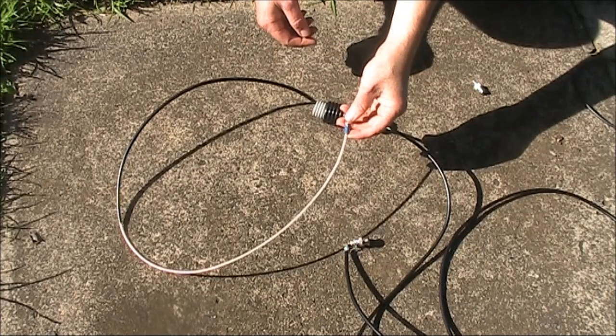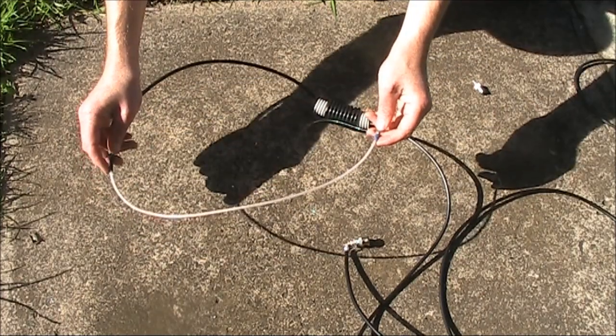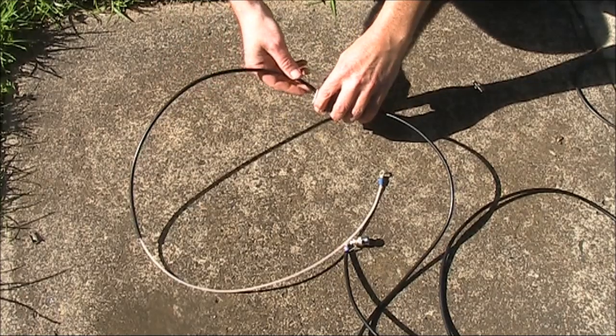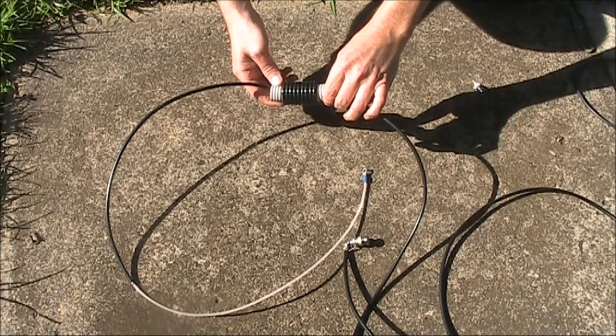The flower pot design is quite a bit simpler. It's just a quarter wavelength of coax inner, just removed by going around the cable with a knife. Then another quarter wavelength of coax, which I haven't touched. That's all exactly as described on VK2ZOI's website.